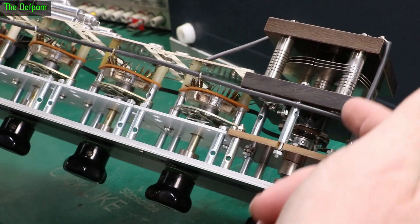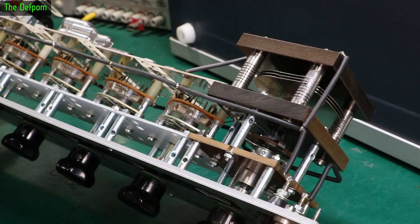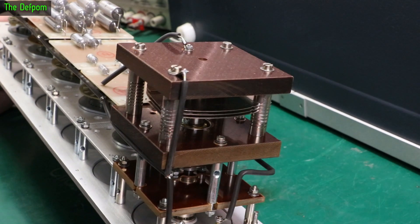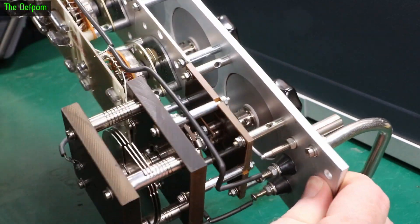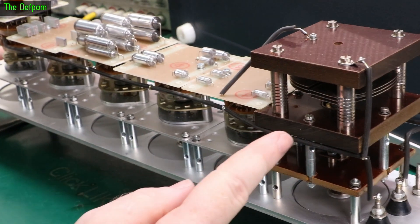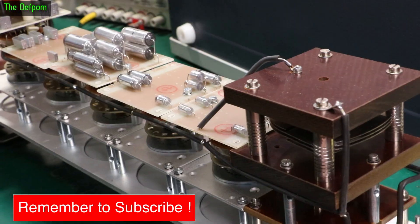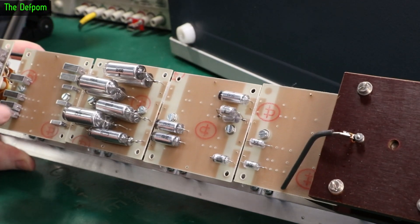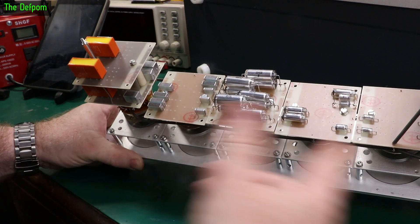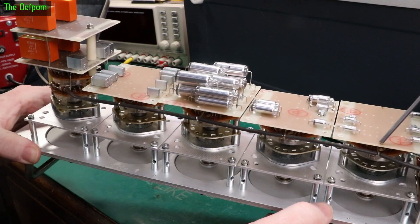Basically you've got this post here that goes through to this line, which comes along and is in parallel with each switch. It's a capacitor, don't forget — capacitors work in parallel, whereas a resistor would be in series. The second post comes up and does the same, going across in parallel with all the switches. This air capacitor goes onto this board here. Interestingly, each decade only has five capacitors, and they've used the same circuit board across all of them, just populated differently. Universal boards — nice, simple, cheap. Really clean construction in here.